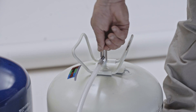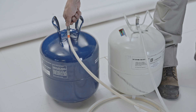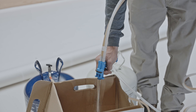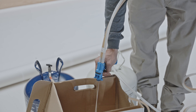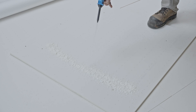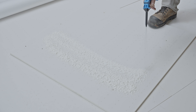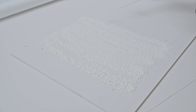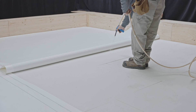Open the valves and check for leaks. If so, close the valves and tighten the hoses. Release the safety valve and press the trigger of the applicator. Watch the product flow through both hoses and run it into a waste container before installing the nozzle. Do a test spray before starting the application, to familiarize yourself with the movement and the speed at which to apply the product according to the climatic conditions.